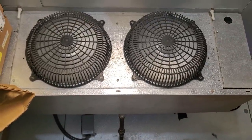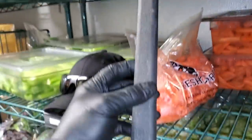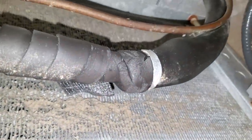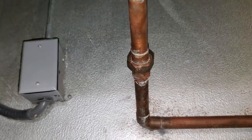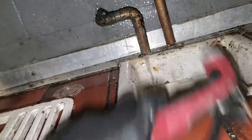We're going to get a water hose out and get this guy cleaned up. It's really not horrendous, but there's quite a bit of lint on there and it's built up inside the coil too. I use this long brush — I just get this at Home Depot — and I try to brush off the bulk of it, then give it a rinse. We're going to flush the drain too. We've got a drain nipple right there. We don't want all that lint to plug up the drain. Drain's flowing. I'm going to get it a spray from underneath — some chunks are coming out.